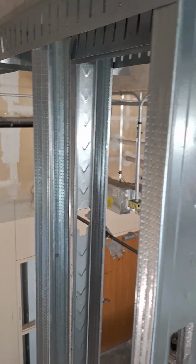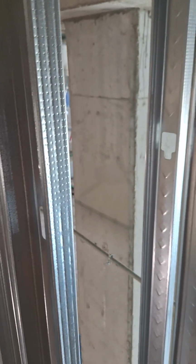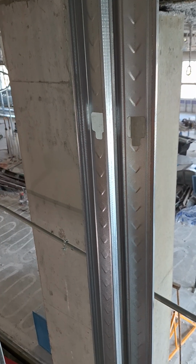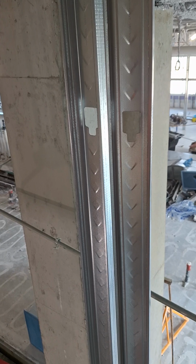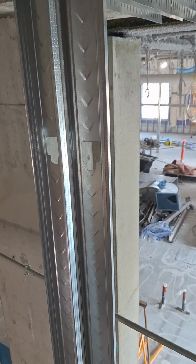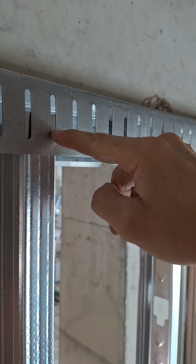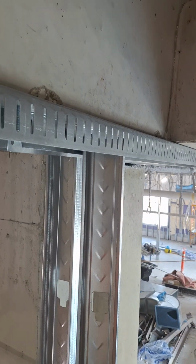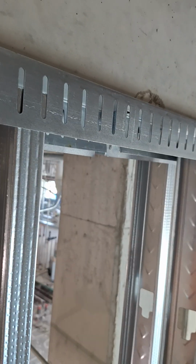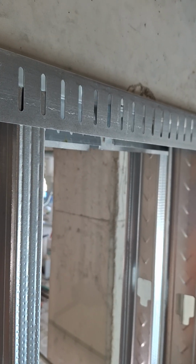But take your measurement in a couple places on a stretch of wall, and then find if there's something that's gonna work out best as an average between them within about 3/8 of an inch of each other. If it's more than that, you're gonna wanna split it up into a few different measurements so that you have enough, so that you're not short, so that you're not down here on one and way up here on another. And the reason being is because this is supposed to deflect. That is the whole purpose of this, is to deflect, be it up or down.